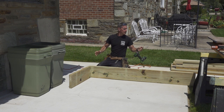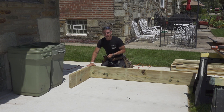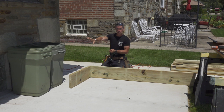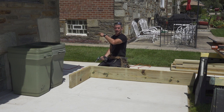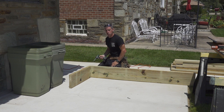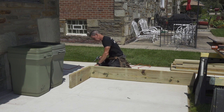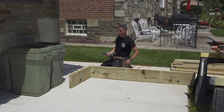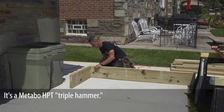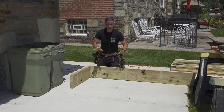We've got a lovely patio out here — nice quiet street, but it's a billion degrees because it's concrete. We're going to build this platform, put it over there, put the trash cans on it, and free up the patio for front-porch fun. Step one is already done: dig a ton of dirt. Step two: make the border with pressure treated lumber, fastened together with number 10 by 3-inch SPAX HCRX-coated screws — three per joint. This impact driver is a Ferrari.